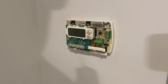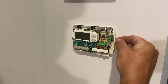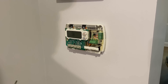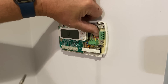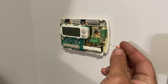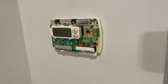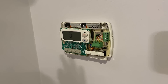Right now if you go to the boiler that red light should not be on. Let's go see — after fixing our connections, zone two light is not on. The only difference was that the jumper that went between RC and RH is now removed. The red, yellow, and green wire is your air conditioning. You can easily identify it as air conditioning by seeing three wires. If you had just two wires, that would only be heating.